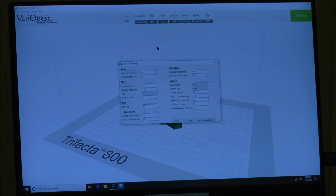I always like to give the example of the Eiffel Tower. If you're printing that, you've got a tall tower with 4 thin, skinny little legs. So your base can get a little wobbly and it can get more difficult to support that taller structure. So for that, you would want to activate brim because again, it's just going to secure the foot of the print to the build plate so that it doesn't lift up or warp on you. Note that when you take it off your build plate, you'll have those thin strands of filament under the base of the print. Sometimes those are a little harder to get off, so you want to use a chisel or a file to file those down. But that's what brim is.